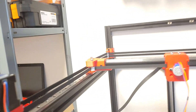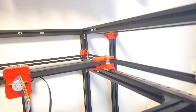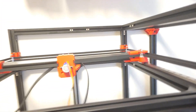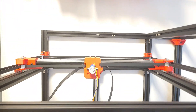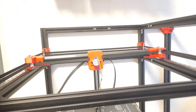Here I've placed all the belts for both motors. As you can see, when I move one belt, both the tool end and the gantry move, and the same goes for the other side - that's the core XY system working. That's about it for the belts and essentially what this whole episode was about: making the XY movement system. Next episode I hope to get started on the electronics, get some motor movement, and test it properly as a core XY to see how straight it is and what adjustments will be necessary.